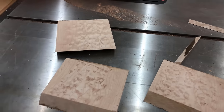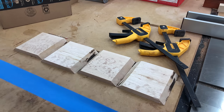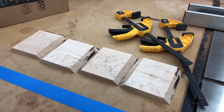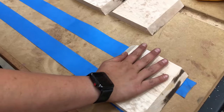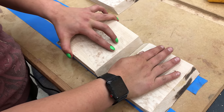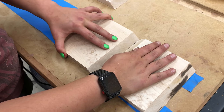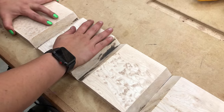Unfortunately, my blade is actually pretty dirty in this video, so we're getting quite a few burns. The burns don't really seem to make much difference when we're doing a glue-up. They'll still bond pretty well, and these are going to be having splines or dovetail keys in them, so they're going to be strong. What we like to do is to set out some tape — basically some painter's tape — to try to help align these joints before we glue them.